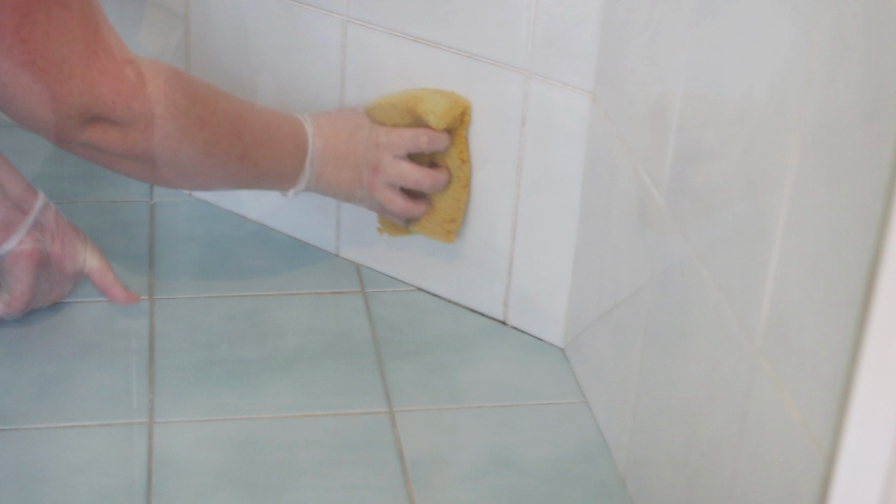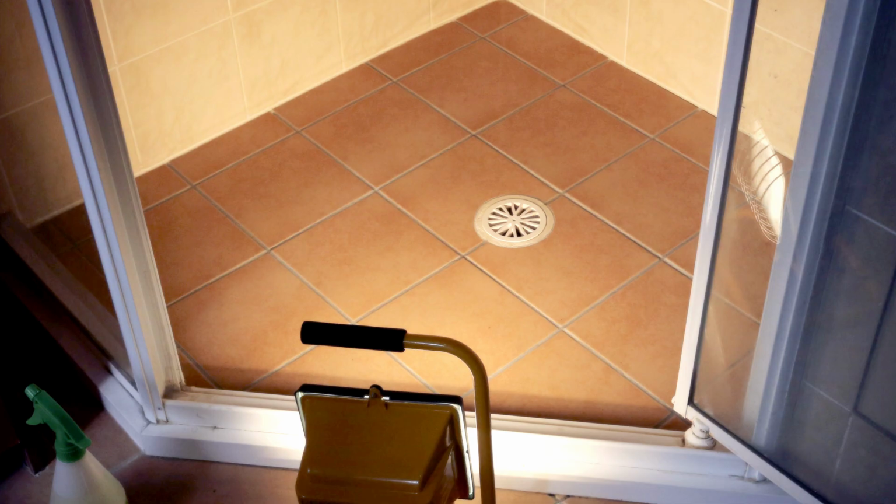You will need to completely remove the cleaning agent, as this can turn the membrane white. But be careful not to flood the area, as it needs to be dry for the membrane. So doing a couple of wipes with a damp cloth should be sufficient for its removal. Then let it dry. You can speed up the drying process by using a heat light or a fan.